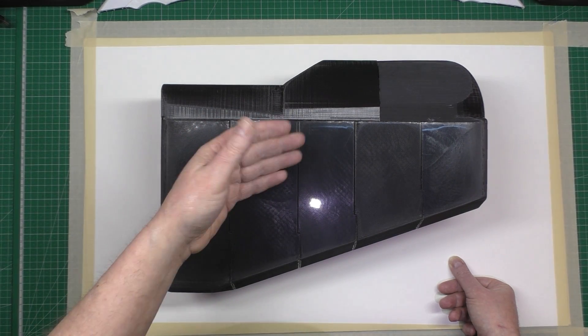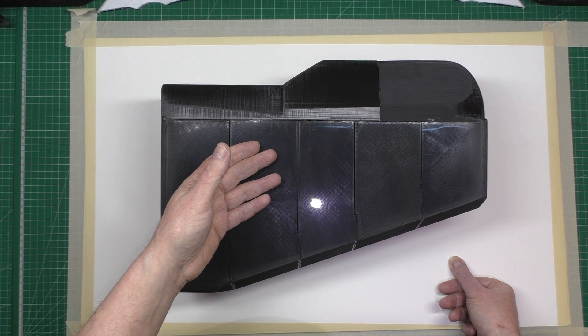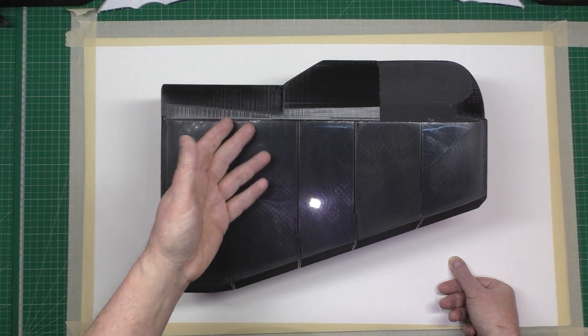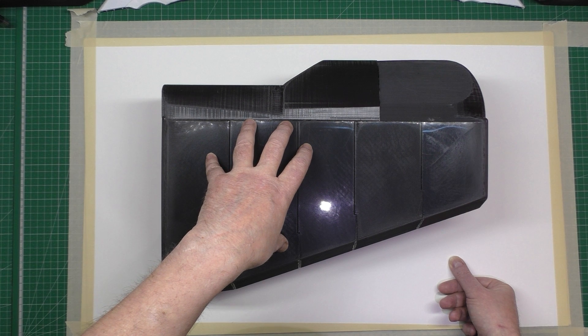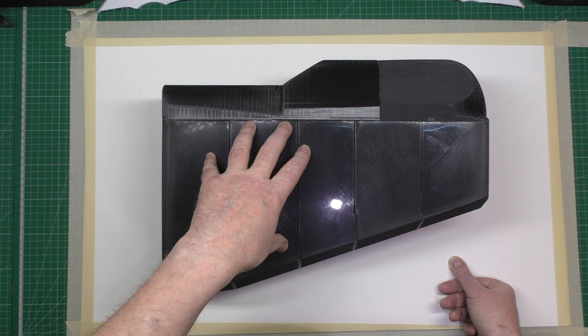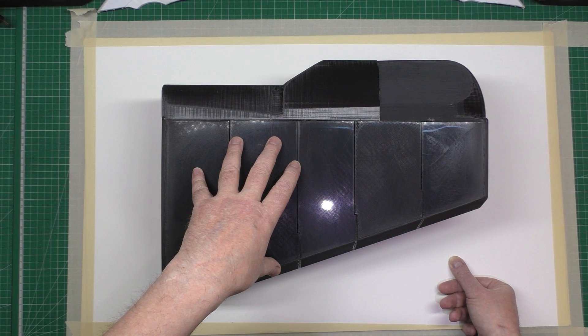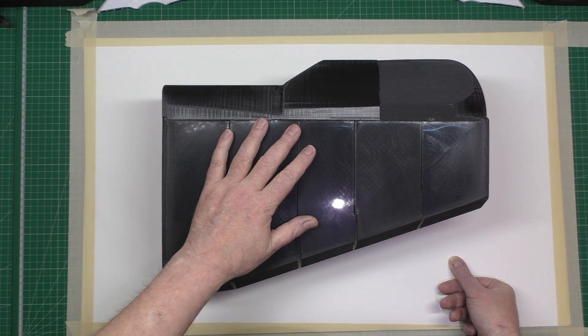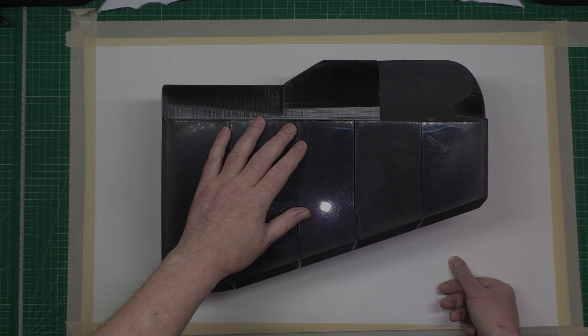After the adhesive I put the wetting layer on - just to wet the carbon fiber - then it's got to be left to go tacky, then I can put another layer on, then another. This is a very drawn-out long process, not a five-minute job. I don't know how it's going to turn out - I want a mirror finish but I don't know if it's going to be achievable. So here we go.